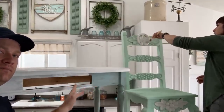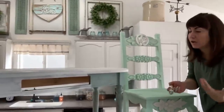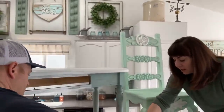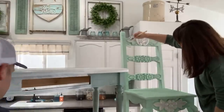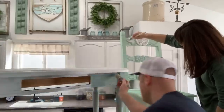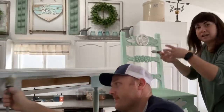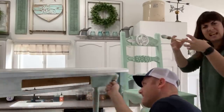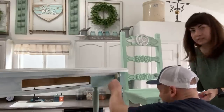So if you're looking at furniture in a thrift store and you want it to be solid wood, you really need to go digging. If it's post-1980s you've got a solid chance that most of it is MDF with just the front pieces being solid wood — it's less expensive to manufacture. People say 'it's really heavy so I thought it was solid wood,' but MDF is actually heavier than wood most of the time because it's pressed fibers, while real wood has grain and is less condensed.